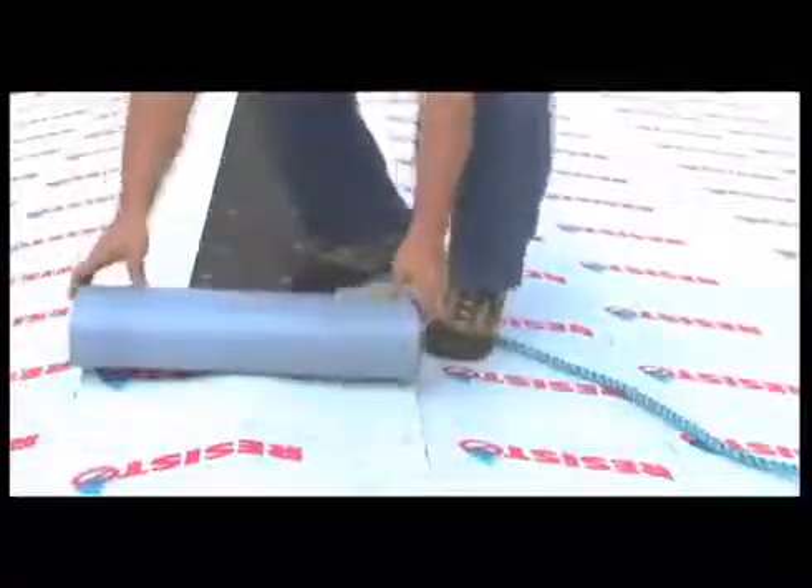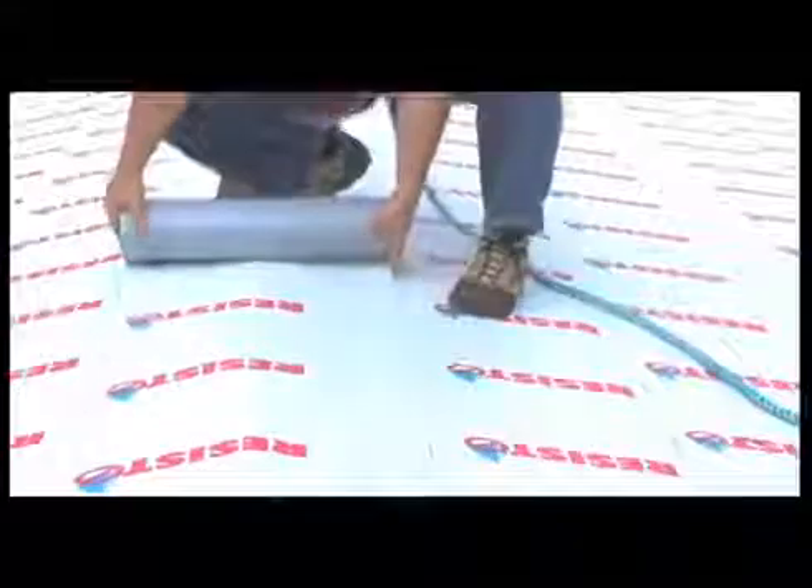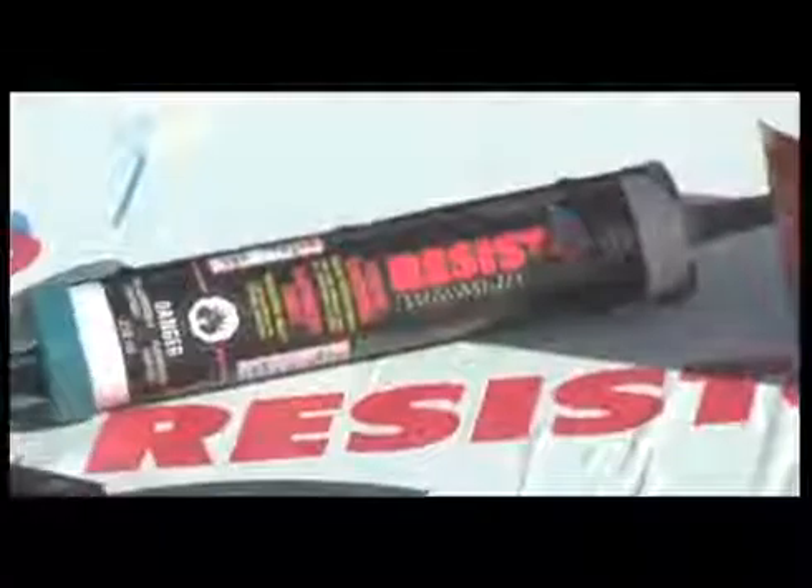Install a final length of base sheet membrane directly on the ridge line. To join two pieces of base sheet membrane, plan an overlap of 6 inches. Beginning at the base of the slope, nail the aluminum flashing into place around the entire roof. Always starting at the base of the slope, apply a strip of red zone, taking care to overlap the border flashing and the surface of the roof. Finish with firm use of a small roller over the entire surface. Roof accessories like vents and fans, chimneys, ventilation hoods and recessed lights must be protected in the same fashion with red zone strip.